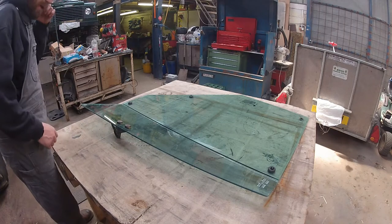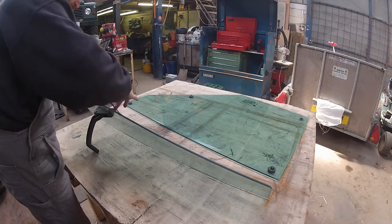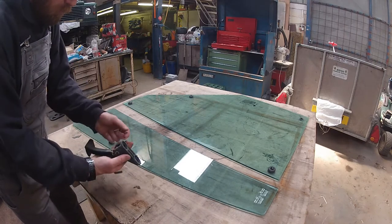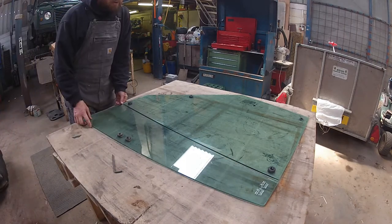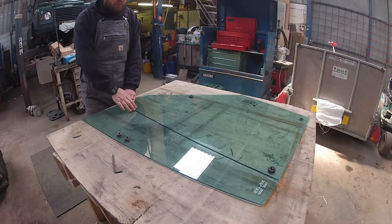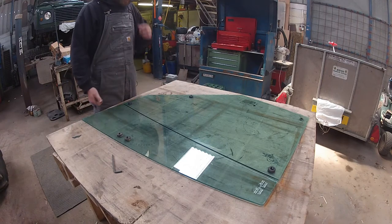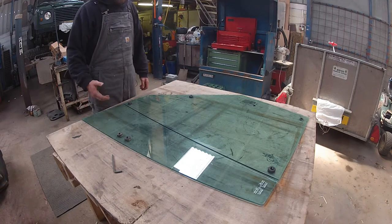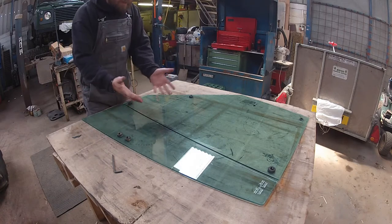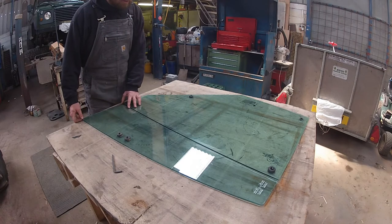So it goes something like that - I'll need that off by the looks of it. I think what I'll do is measure the gap on the other side, the bead of silicone. I need something on the back side with a release agent so it doesn't stick to it. Fill it in, scrape it off, pull the masking tape off down either side and then leave it to set. I think the majority of this job is in the setup, actually.